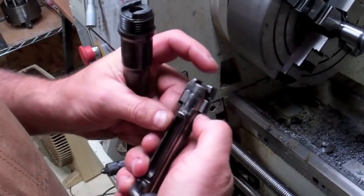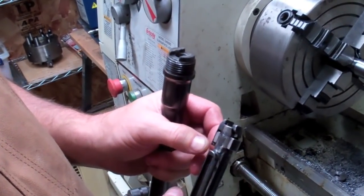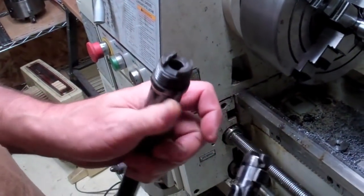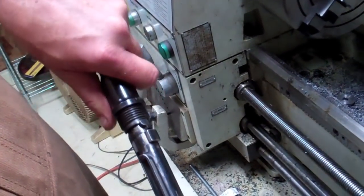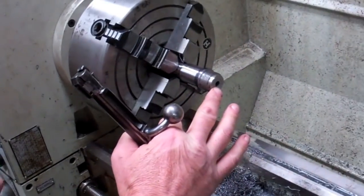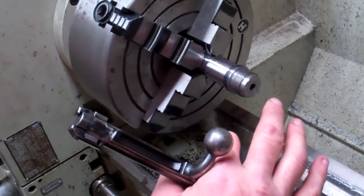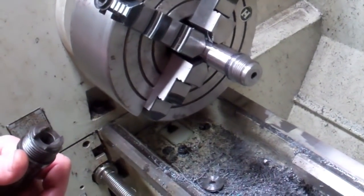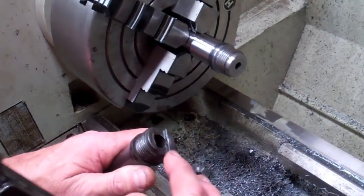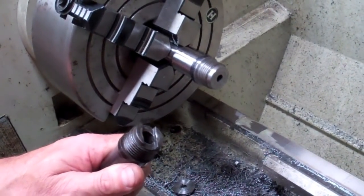Notice how you've got the two little lugs on here, the extractor and the ejector. On these G9840s — these Hungarian M43s — you can see right there moving up and down, that's your ejector. Those pieces are going to fit right in here just like that. So before I set the final headspace, I'm going to take a boring bar, go back in here and ream this out, get it close to size, take a chamber reamer, get it close — but before I set the final headspace depth I have to cut this slot all the way across in the milling machine. That will be milling machine work for a different video later.